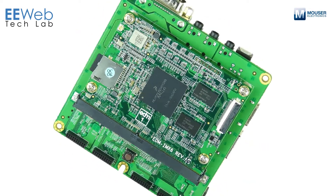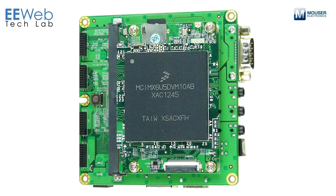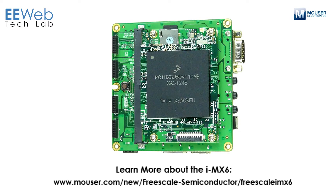On the processor board, you have the Freescale IMX-6 series processor. Now on the quad version, you can run it up to 1.2 GHz. The entire series integrates just about everything. There are some differences from the solos to the duals, the duals to the quads. But as far as what's integrated, you have 3D graphics, 2D graphics, 3D HD video playback, SATA 2, and more.